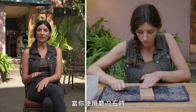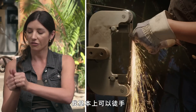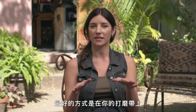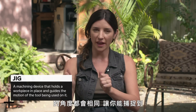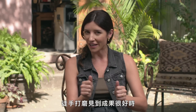When using a whetstone, the most important key is to maintain your angle. I'm so familiar with sharpening my own knives that I can essentially freehand on the belt sander and then clean it up on the whetstones to create the edge. If you're just starting out, the best way is to set up a jig on your sanding belt to the exact angle — you place your knife in the jig, it's the same every time, and you get that muscle memory of where that exact angle is. Some people prefer to always use a jig. I like to be a little more loose in form — it's really a personal preference.